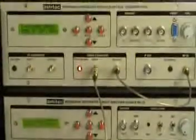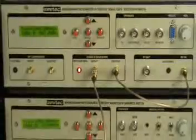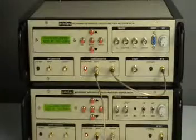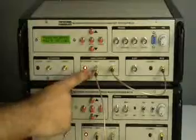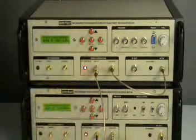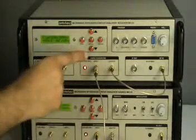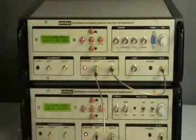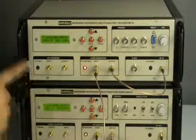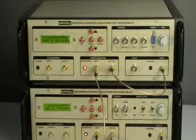Frequencies from 48 to 860 MHz are received at the SMA connector in the RF input block. Frequencies from 861 to 2000 MHz are received at the SMA connector in the down converter block. A cable has to be connected from the down converter output to the RF input block. The corresponding LED will be glowing depending upon the display in the LCD when the corresponding block is being selected.